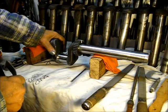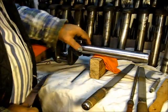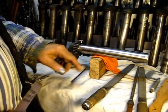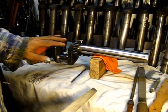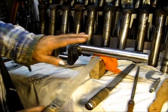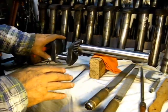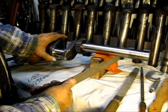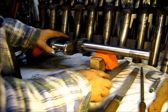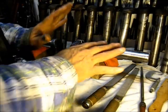I did put this in the vise over there with the wooden jaws, clamped it in the vise, and then I worked this with a file until it was almost usable. That's another thing about using a file — if you're going to work on these old engines, a file will be your friend. You should have several good files. A lot of old machinery was hand-fitted with a file, and you can do really good work with a file. If you're going to work on these engines, you should be proficient in file work.